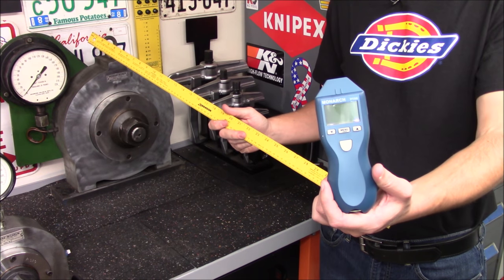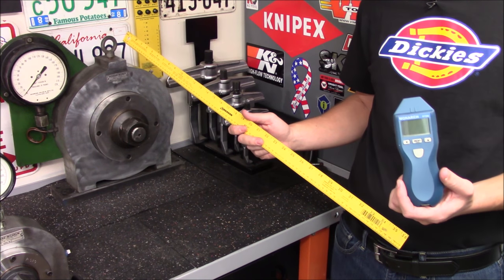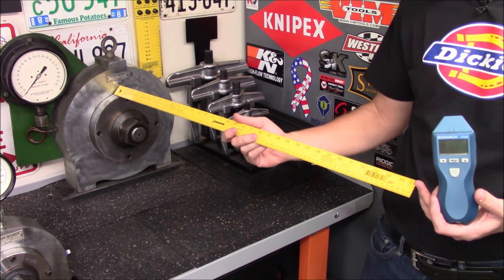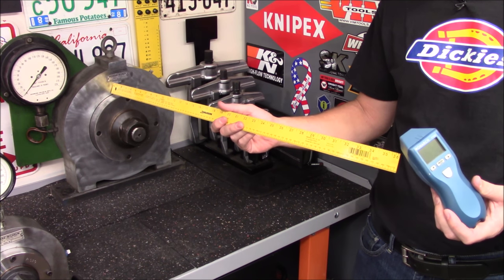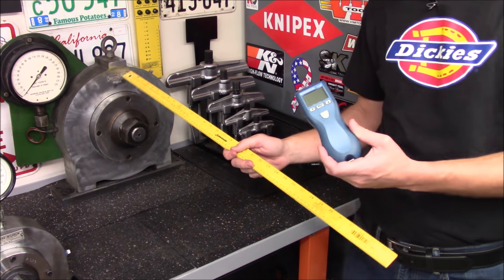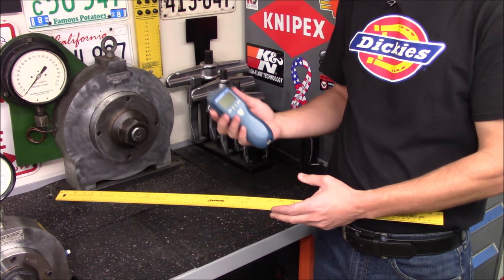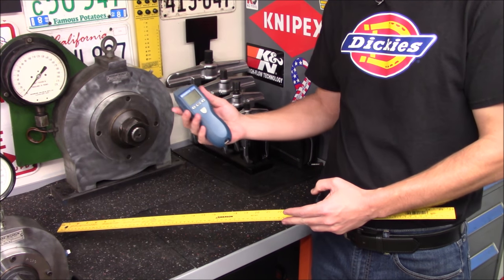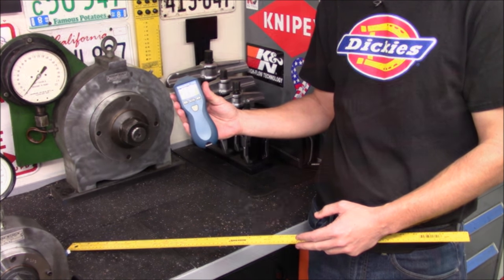There will be limitations with the unit. If you run into a problem, perhaps you're just too far away — it has a maximum working range of three feet, or 36 inches. If you're farther away than this, it can't accurately pick up the reflective tape as it spins. So if you do have a problem, just move the unit closer to what you're trying to read and most likely that's going to clear up the issue.